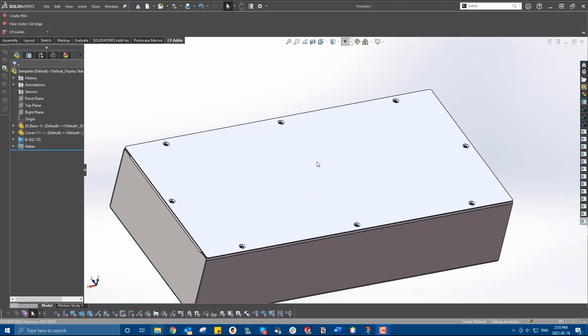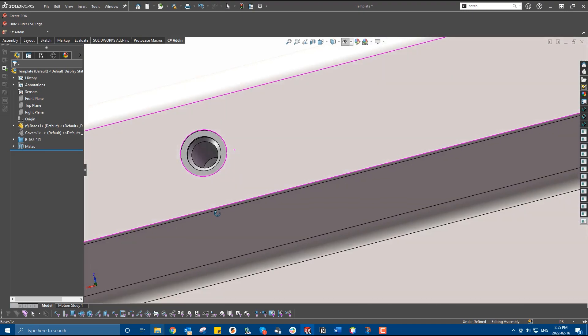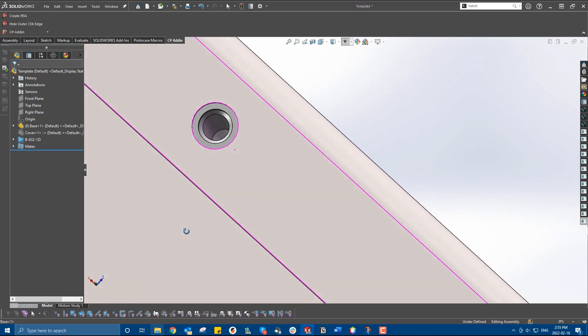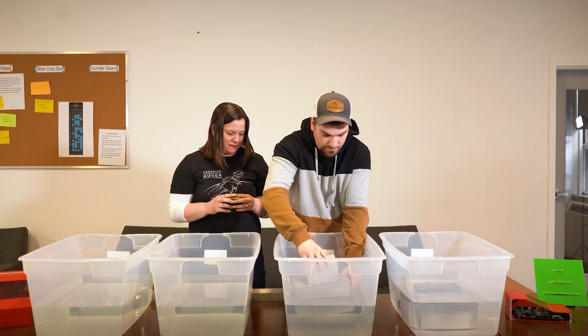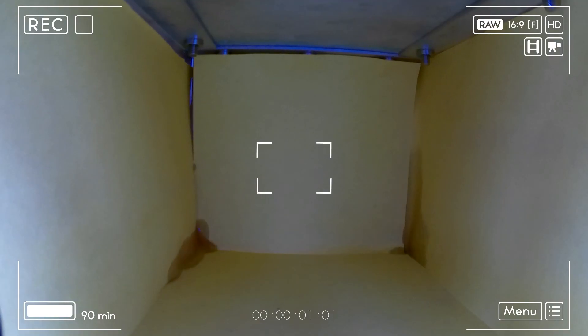Next up: fasteners. You want to make sure that your enclosure has proper fastener sealing in order to prevent water from coming in through the mounting holes. We recommend blind nuts and blind standoffs — a blind nut encapsulates your threads, which prevents foreign material from entering. During your design process, you can place your fasteners strategically so they do not protrude inside the case. You can also assemble with sealing screws or use a latch and lock to fasten the enclosure fully closed. We did our own Proto experiment where we tested different types of enclosures by submerging them in water. While it's not meant to be the definitive scientific test for waterproof enclosures, it's a great quick video that will give you some food for thought — check out the link below to watch it in full.